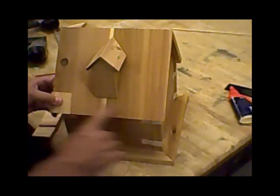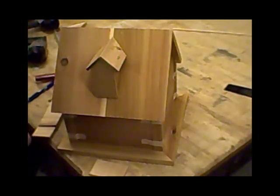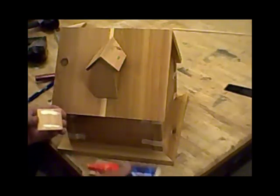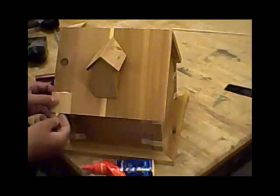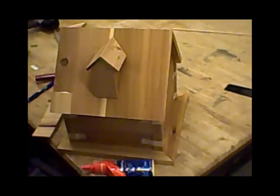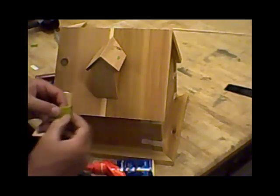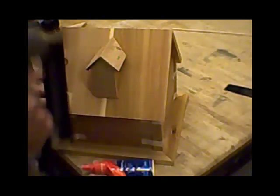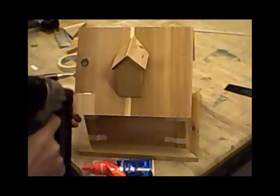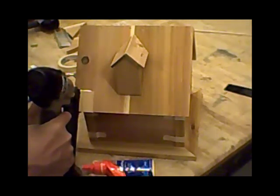To mount the shingles, the first row is easy because they're going to be perfectly flat right against this. I use glue when I do this because sometimes the nails don't hold all that terribly well, so I put a strip of glue on the top and a strip of glue on the bottom of the shingle. Set that shingle into place, getting your overlap if that's what you want. It's not going to stay there very well if you let go — it'll tend to slide down the roof. So you're going to use the staple gun. When we were stapling the base, we used staples that were an inch or an inch and a quarter long. This time we're only going to use staples about half that length so they don't go through the roof. We're going to staple all the way at the top of the shingle so that the next row of shingles covers the staples and they cannot be seen.